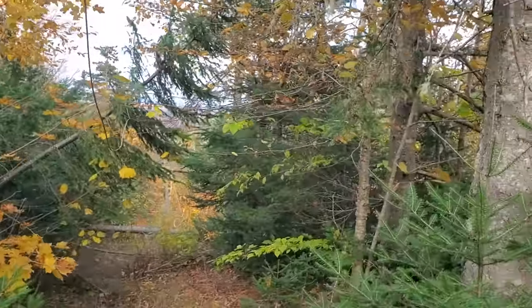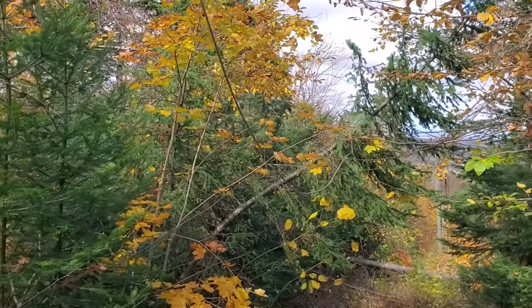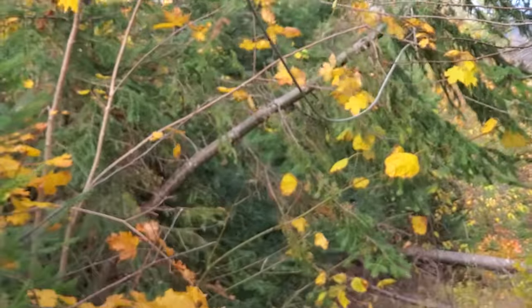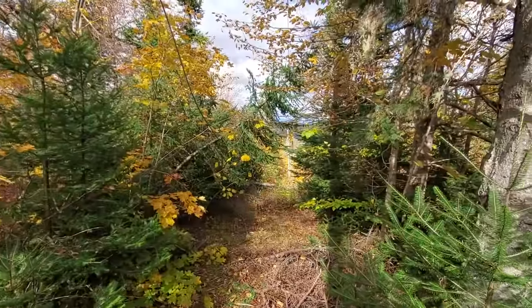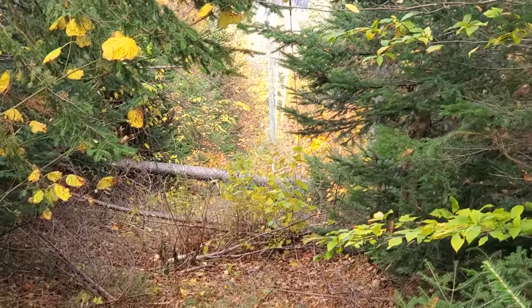This guy swaying back and forth in the wind right here — that's the primary. There's no danger of step potential where I'm standing. Probably the closest hazard is that little tiny tree; I wouldn't get any closer than that. If that were energized there could be some step potential near that tree. And if we look down the easement, way down, that's the tree that caused this whole mess — took out the primary and neutral, ripped it right off the mainline pole.